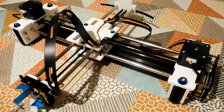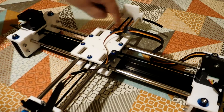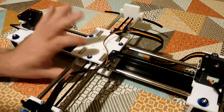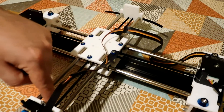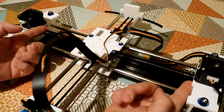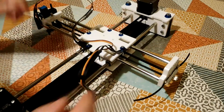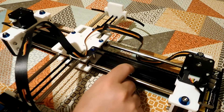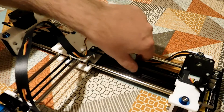The next thing is the belt. The instruction manual implies you assemble the bottom part of the plate with the bearings, then fit the belt, then put the top plate on — but that's actually impossible. What you need to do is assemble the whole plate, rods, and bearings, then thread the belt through from front to back, round the little wheel at the front, and back through, pulling the two sides out and looping them onto the stepper motors. Then just pull the two ends tight and tighten down the thumb wheel to lock off the belt. It should be just tight enough to twang when plucked, but not rock hard.